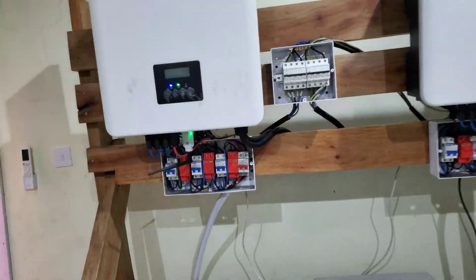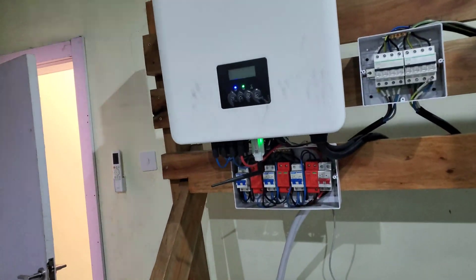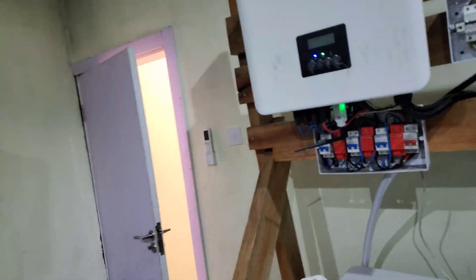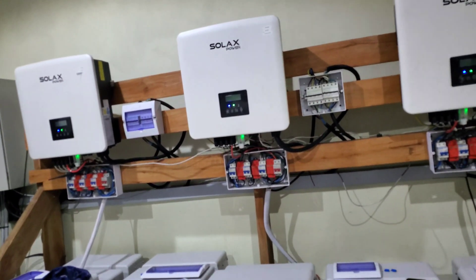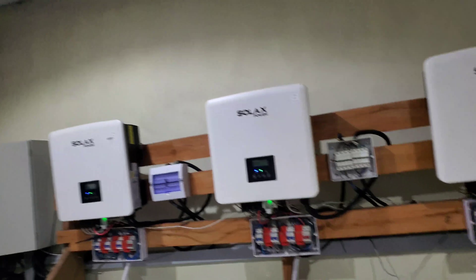Let me respond to the first few things. One, we're putting a smoke detector with an outdoor bell or gong that will ring once there is smoke or anything that happens. Number two, a fire suppression system is in the works and it will use powder instead of gas. The reason that's going to be chosen is because of the way the room is done — it's not airtight.